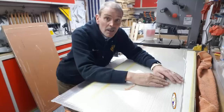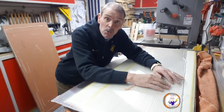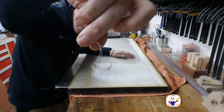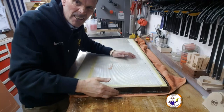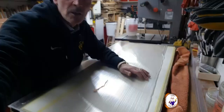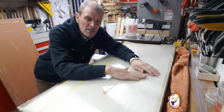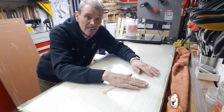It's come out of the mould in one piece, which is great news. All I've got to do now is clean off these bits of silicone around the edge that have come out of the mould — they don't come off very easily, it's well sticky. One problem is where I used polycarbonate instead of polypropylene — this stuff has got all these ribs on it, so on the bottom I've ended up with a ribbed pattern. I was hoping to avoid hours of sanding, but the bottom might need to be sanded and polished. The top is okay but the bottom is a little bit ribby.